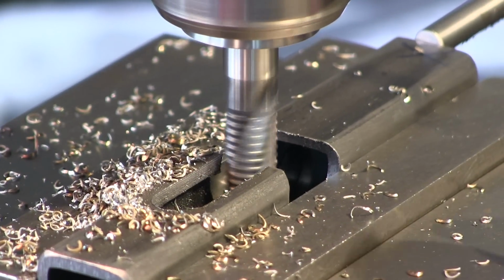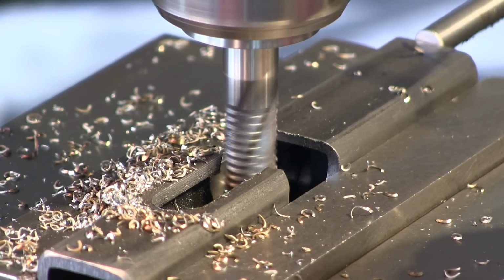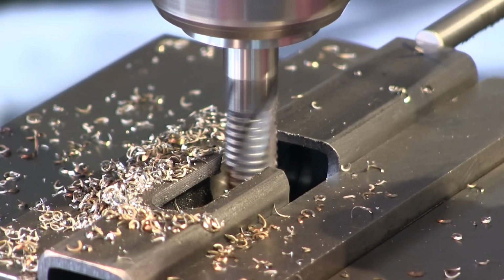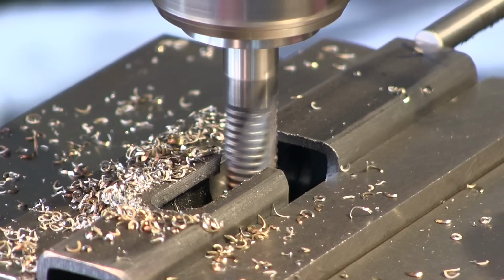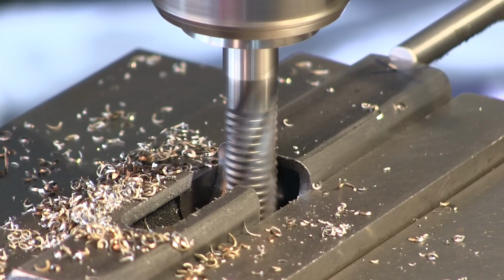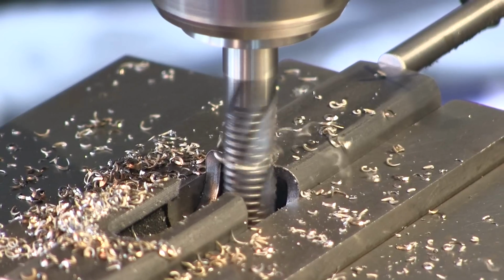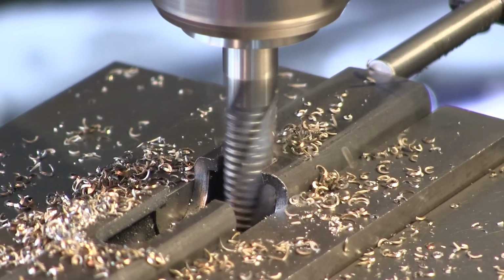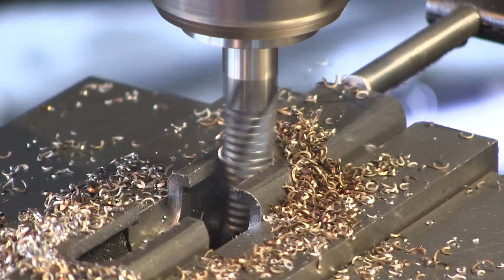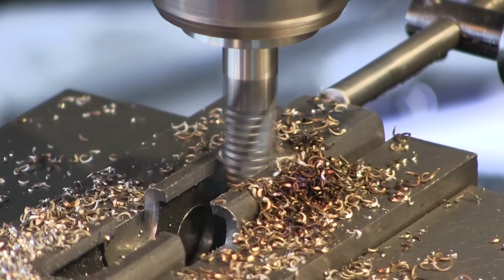You know why you cut on the way back from the end mill? Because the force of cutting pulls the tool, it flexes off to one side. And then when you're coming back, of course, it's relaxed from the amount that it was pulling itself over with the cut in the direction you were going. And when you come back, it relieves that pressure, so you end up cutting on the back side. That's why it's important to go ahead and plunge cut. An end mill cut should be plunged to the bottom and done in one stroke. Otherwise, you're going to have lines up and down your bore or your slot that you're cutting.